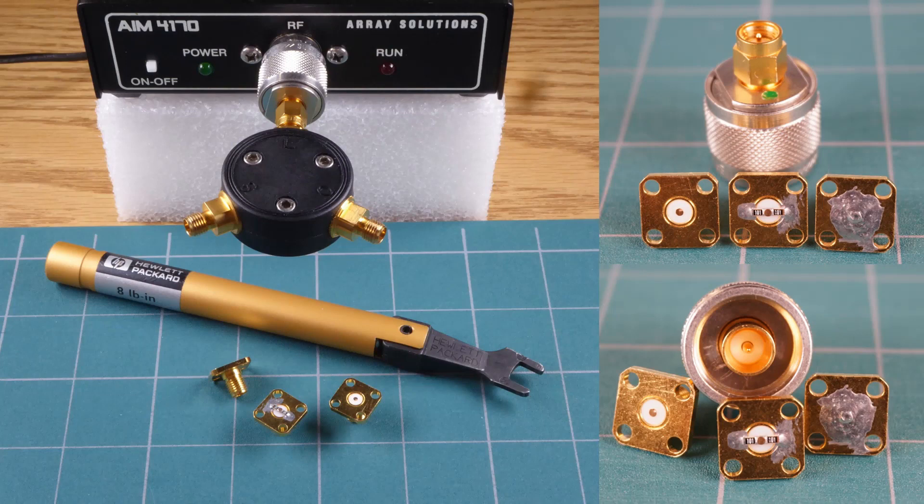In those videos, I took three identical high-quality connectors and made a flat plane, whether it was machined or — in this case all I had to do was grind off the center pin. I had an open, two small 0805 resistors, and a thin piece of copper or brass that was soldered for a short, and I measured those. I came to the conclusion that they were good out to about a gigahertz and used them accordingly.